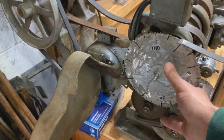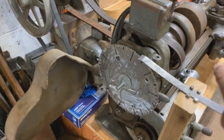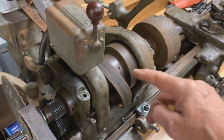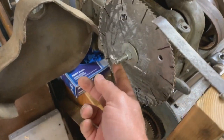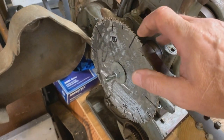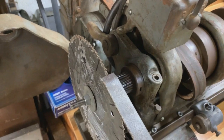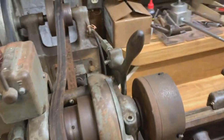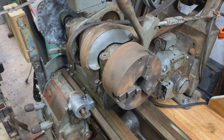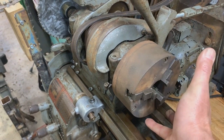You can see it ratchet around. I made an expanding insert that fits right inside here, and then this bolt — when you tighten it — expands the insert, which locks the saw blade onto the rest of the assembly. It's pretty handy. I don't need it as an end in itself, but it will be part of a tool to accomplish another task.